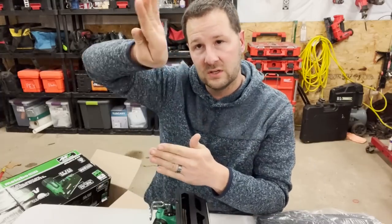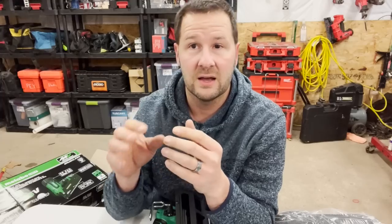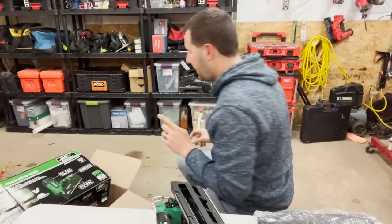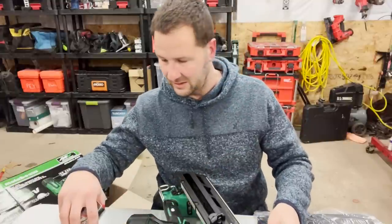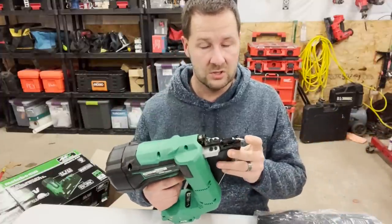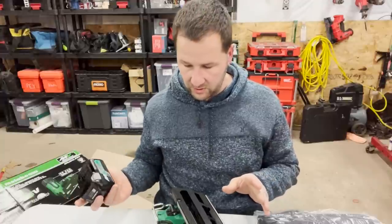I can pound some by hand, but the other direction of the hurricane tie is between two joists. I could only swing a hammer to do about four hurricane ties — which have five nails per half, so 10 nails per tie — and I got to a point where I couldn't swing a hammer in a 14.5-inch gap. I measured from the tip and it is 14.5 inches, so between a traditional floor joist span or wall stud it should fit.